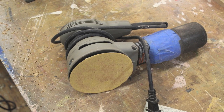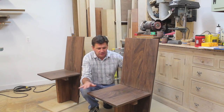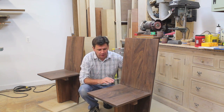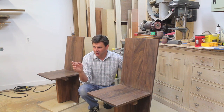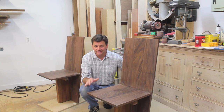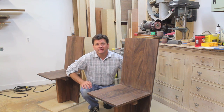Quick recap: once I've finished sanding with 80 grit on the orbital disc sander, I move on to the palm sander using C weight 120 silicone carbide paper. Once I finish with the palm sander, I sand by hand using A weight 220 sandpaper. Once I start to apply the finish, I sand between each coat with 320 silicone carbide, also A weight paper. Right now the chairs have three coats of finish and they'll be done at five. I'm using Waterlox, which is a tung oil finish. The chairs will cure for about seven to ten days and then be hand rubbed, which is a whole other video. I hope you found this useful, thanks for tuning in.